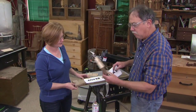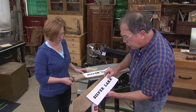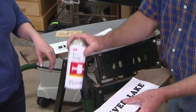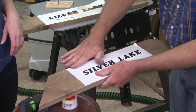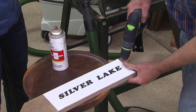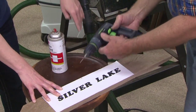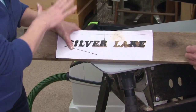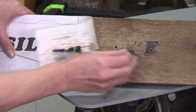I got the board for you. You can see the channel in the back for the beautiful artwork. There's my center point — the ends are mitered. I'm lining up the Silver Lake pattern right on the center point. On the back I use a temporary bond spray mount adhesive, and let that dry for about three minutes — if you put it down wet it's hard to get off. She's going to start scrolling the name Silver Lake, and I need to drill a pilot hole at a four-and-a-half degree angle to pierce the blade through.